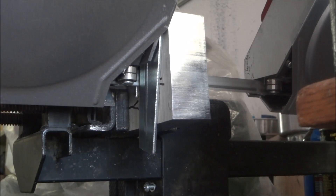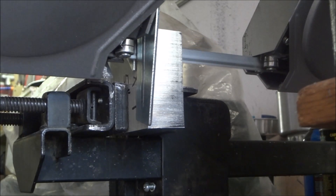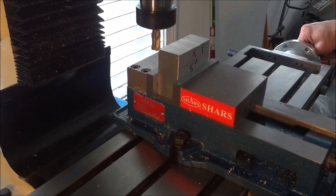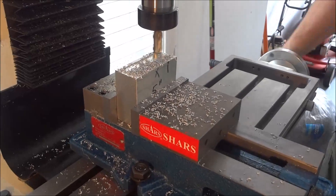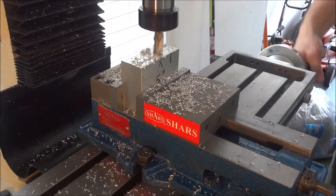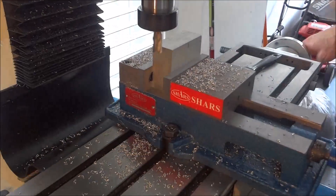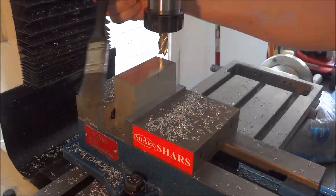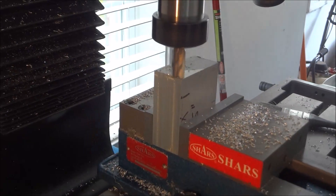Just as before, we've taken stock and I'm cutting it to rough dimensions using the port-a-band. If you don't have a port-a-band, this is something that you really want to get. I started out trying to just use a sawzall and a hacksaw — that really just doesn't work. Port-a-band really does the trick and they're very inexpensive — you can pick one up at Harbor Freight for like seventy to eighty dollars on sale. We're taking the stock out to the Precision Matthews and I'm just sizing everything up, machining all four sides. The Precision Matthews does a real good job — pretty happy with the mill overall, even for a manual mill. It does a really good job and it seems to be pretty robust.